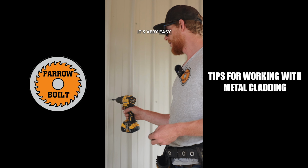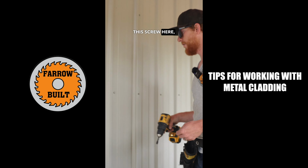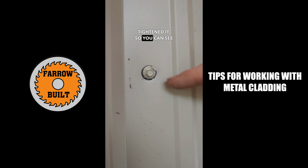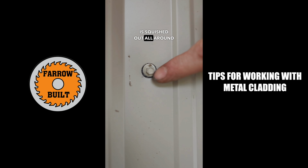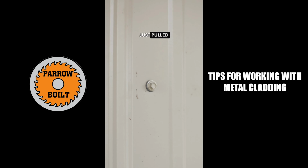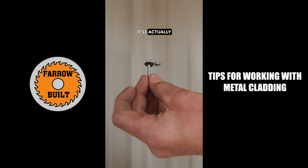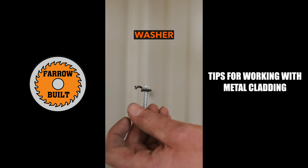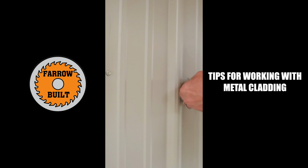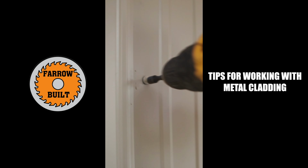So we're just talking about screwing metal onto the wall. It's very easy to over tighten screws. If you come and look at this screw here, I over tightened it. So you can see that black washer is squished out all around the sides. If we look at one that's done properly, like over here, that washer's just pulled snug. If they're tightened up too much, it'll actually destroy that neoprene washer there. It's not waterproof. Just run it in and then go nice and slow just till it sucks up.